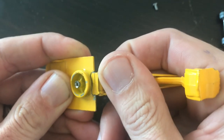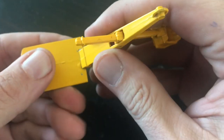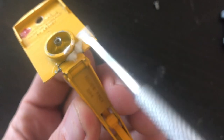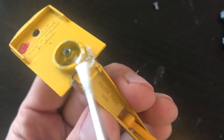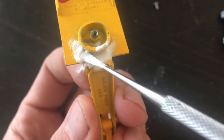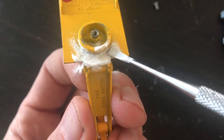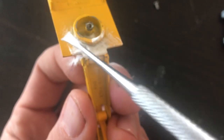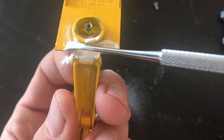So we're just going to try to glue this. I put just a very light little piece of glue, and then it's really important to press it in, hold it, and get it set right where it belongs. That's had a couple minutes to go off, and you can see we've got a nice, tight line there. I'm going to go over that with another very light coat of glue and a little bit of baking soda, really just to strengthen and reinforce that crack.